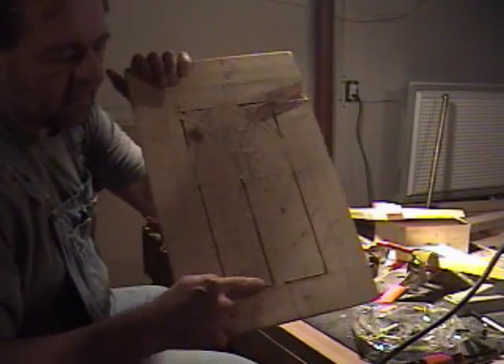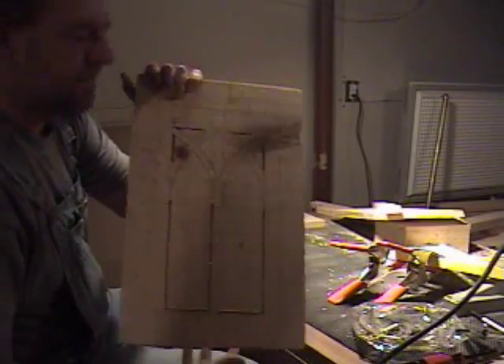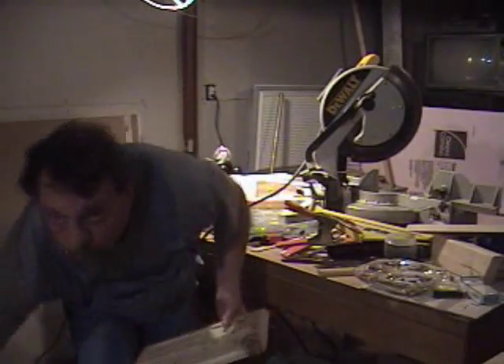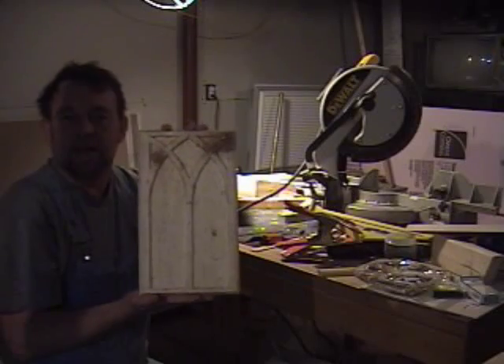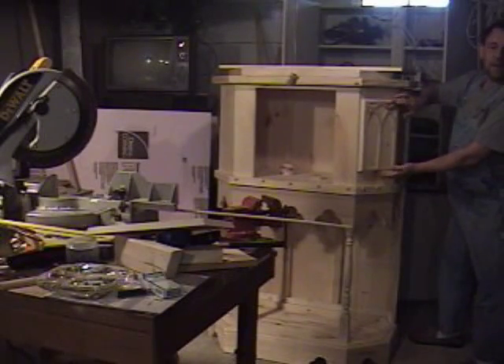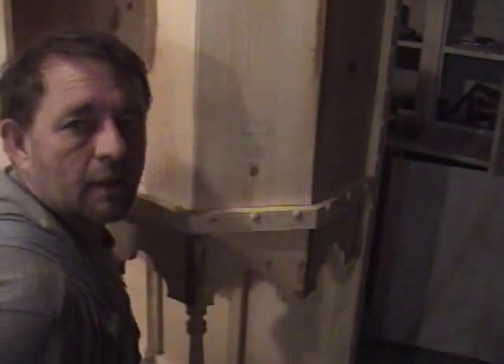I can get a good straight line, then go back and cut out the insides and do my arches. I've got everything routered out and took it to the table saw and beveled the edge around it, so now I've got my gothic panel that I'll just be able to glue onto the cabinet. That gives it a raised panel look.